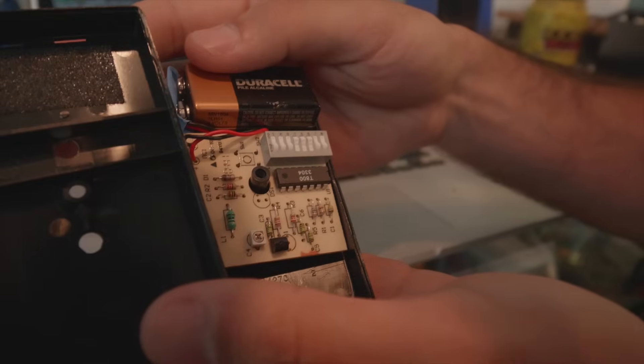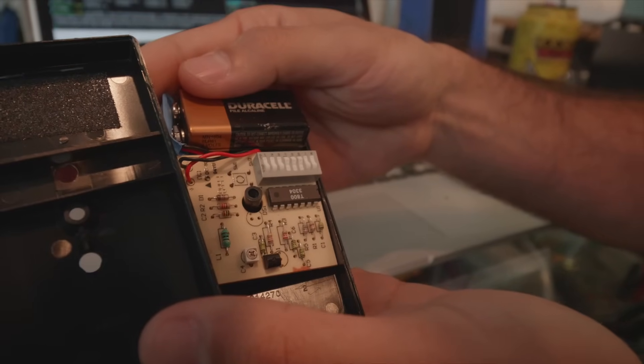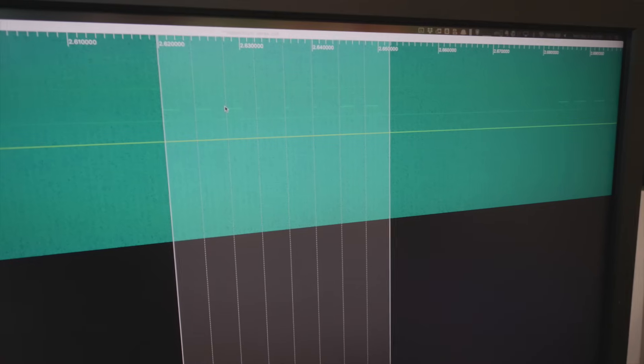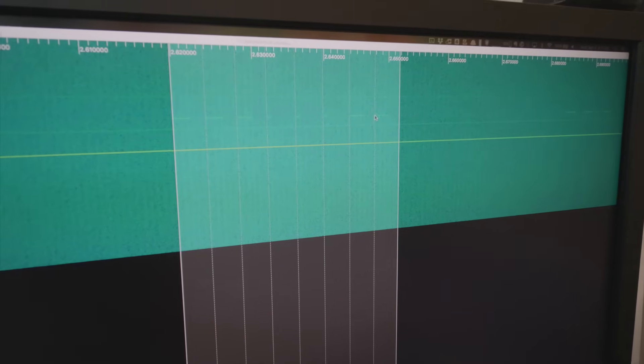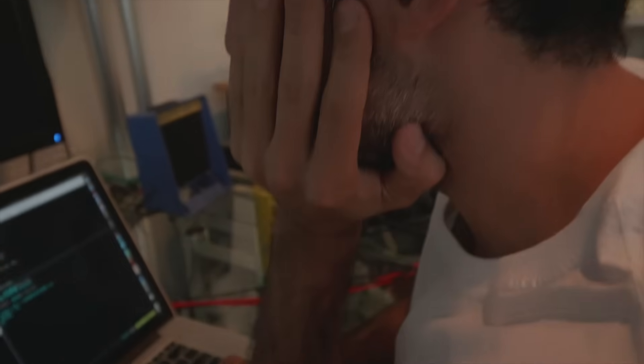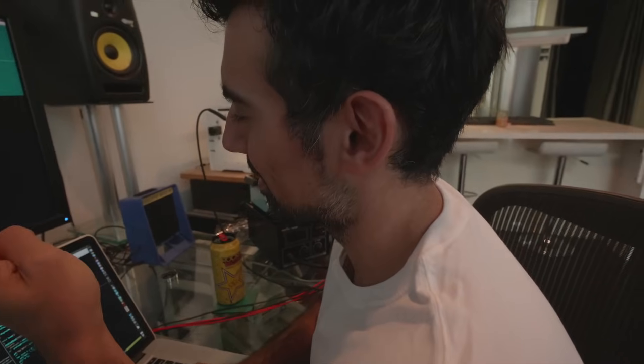Here we have the dip switches. We basically see low, low, low, high, high, high, low, low — long, long, long, short, short, short, long, long. It's not like there's any special message format or anything. This is really the most basic transmitter you can make. Two to the eight is 256 possibilities to open your code. Now let's see how long this period of data is. This is about 32 milliseconds — 32 milliseconds to send a single code. So if we did 32 milliseconds times the 256 possibilities, it would take 8,000 milliseconds — 8 seconds to open your garage, testing every possible variation of the code.